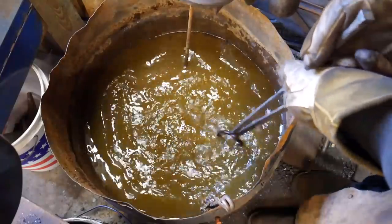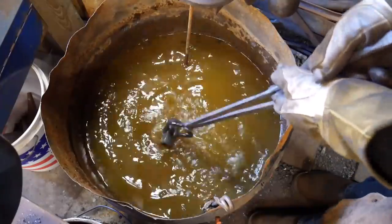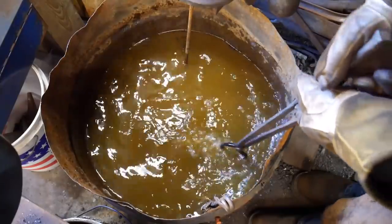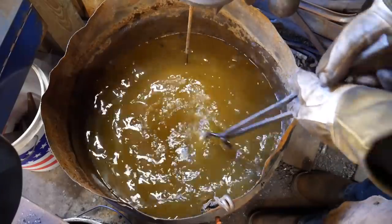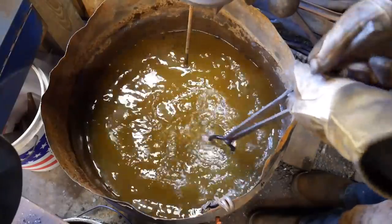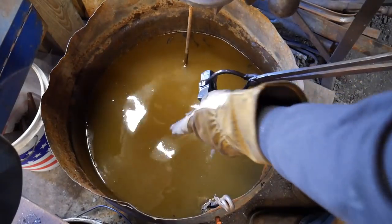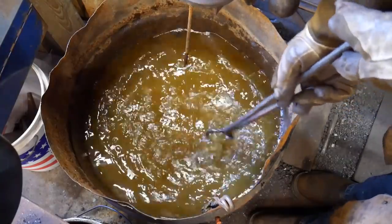That cavitation is the air bubbles you see off the side of it. They form on the surface and, with that Leidenfrost effect, prevent water from fully hardening the tool. So you want to cool this all the way down, make sure it's cool and no longer sizzles. If you see a little bit of steam come off it, just make sure it's all the way cool and put it right back down into the tank.